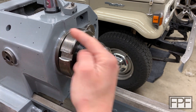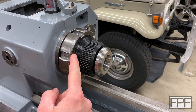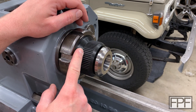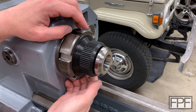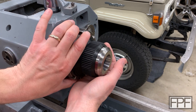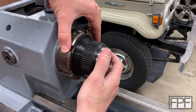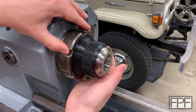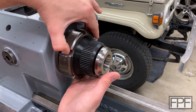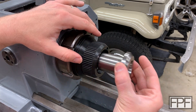Now, when I take this collet adapter and give it a knock in there, it's in there — I'm not going to get it out just by pulling or working it back and forth. The spindle goes all the way through about 14 inches in that direction. But because this spindle nose protector is threaded, as I turn the nut, it starts to back off and then pushes the protector forward — driving the adapter piece out of the spindle. Let me put this in back gear to lock up the spindle, and as I continue to turn it... it just popped and drove the piece right out.